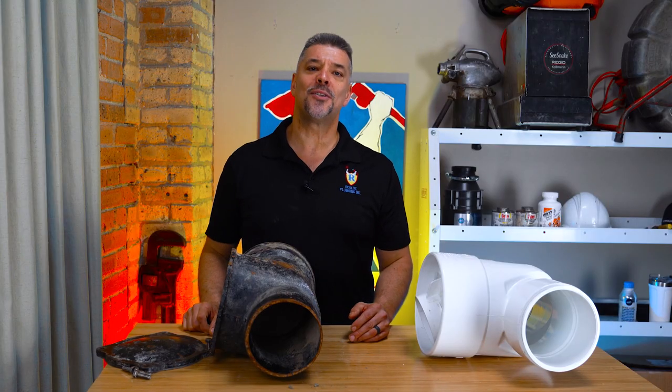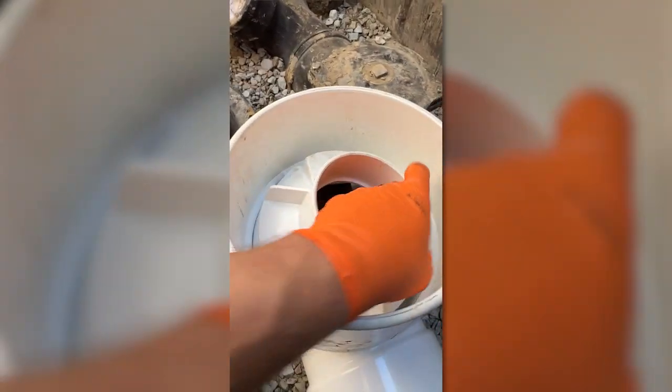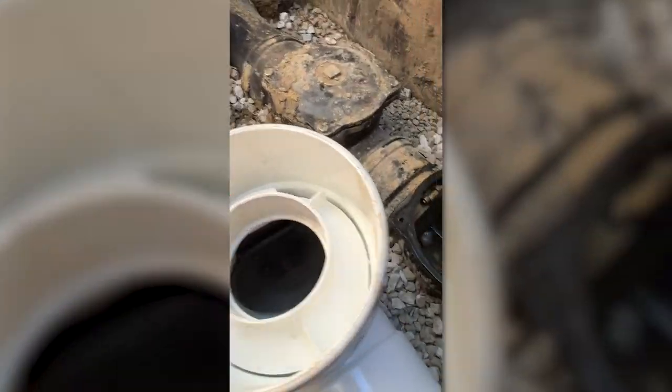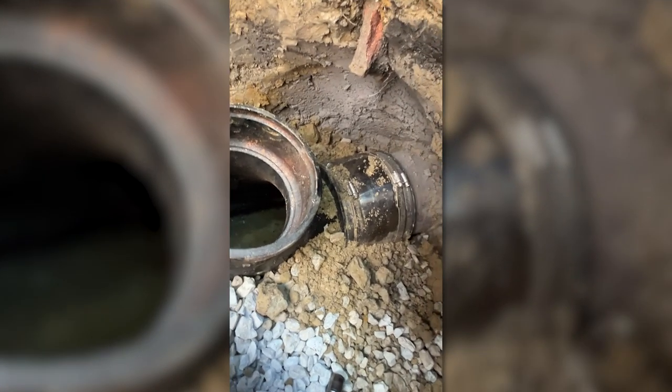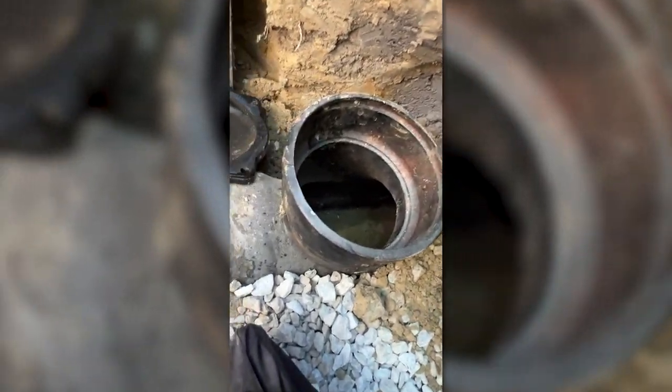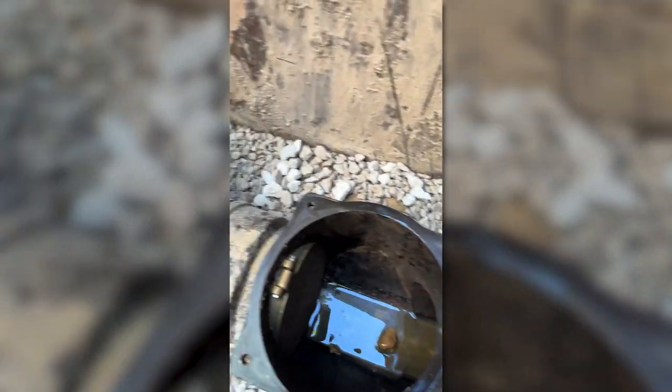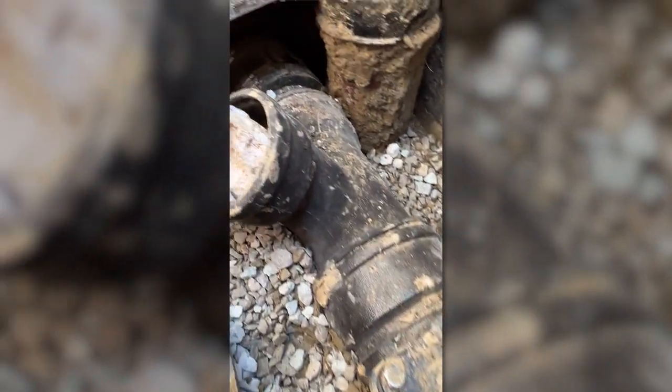Let's dive back into the flood control. The reason they call it a clean check is you can cleanly lift it out and check it. So here in the full flood control system you've got the clean out, the first valve, and there's another one behind it — you can see the top to that one. Full flood control system.